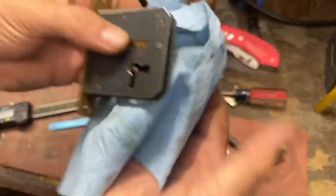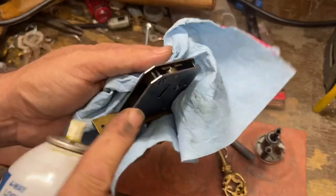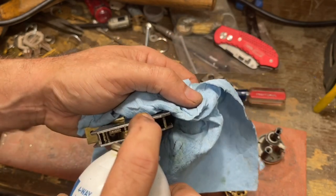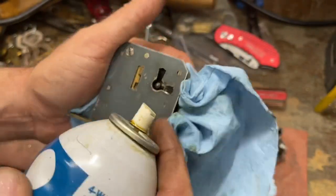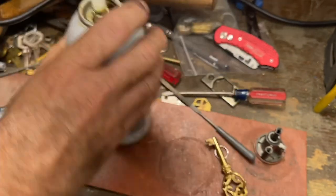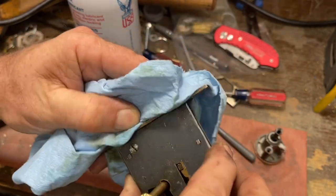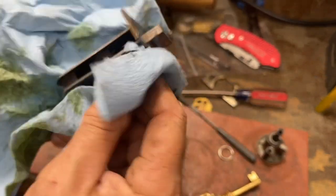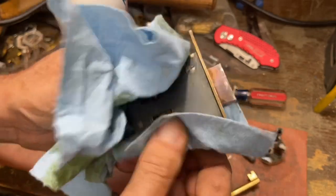Forgot one thing. I didn't do a lubrication with this. Some people have asked about that. I could take this apart and show you, but literally there's no reason for me to. There is an unknown lubricant. I did not put that grease or that oil in there. Not knowing what it is, maybe it doesn't have a WD-40 smell, and it may in fact just be older oil. But what I'm going to do here is hose it out with Houdini, let that dry, and then come back in with our turbine oil. Not really necessary to use a contact cleaner, but there's definitely a foreign lubricant in this guy that you don't want to leave there if you're not sure what it is. So I'm going to let this Houdini do its thing for a minute because it does serve as a cleaner as well. It just needs a little time to air dry, so we'll be back in a second.